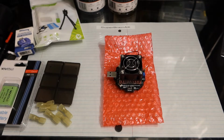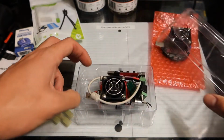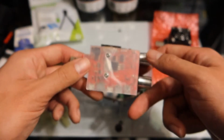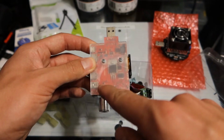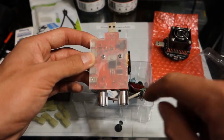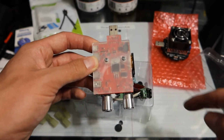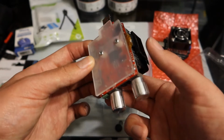So the reason why I bought that is, well, one, 65 watts versus the 35 watts of this guy. But unfortunately, this guy seems to be dead. He acts like a direct short, but I've tested the transistor inside, and that isn't a dead short. It works normally. It's actually this little op amp down here. So you can go watch the teardown and poke through of this guy. So I need to find a replacement for that op amp. Somehow it got shorted and it's feeding power to the transistor, which then shorts the output.